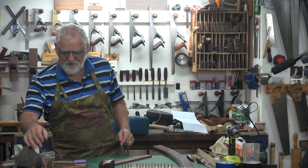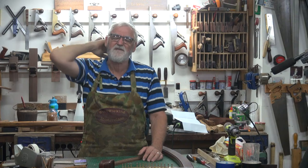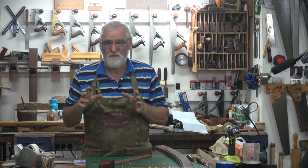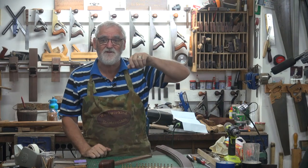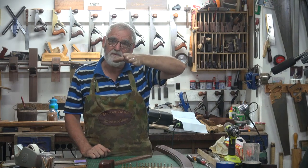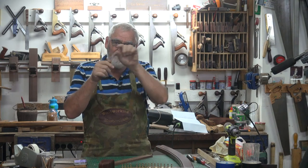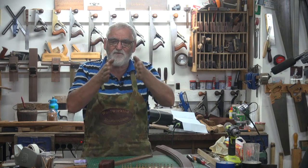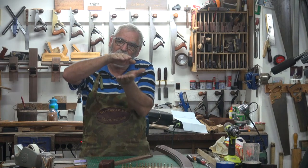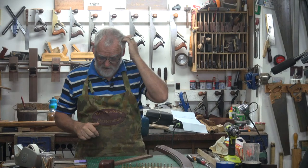And then I realized, because I bought a budget ER32 collet set for it. I actually got the collet holder yesterday and put a straight edge on it. And one side has got a bit of a hump in it. So when I'm machining one way, if that hump is between my jaw vices, not a drama. But once I turn it onto the bottom, that hump then moves the collet up about 0.5 mil. So I'm actually taking 0.5 mil off. So I've got to machine those.